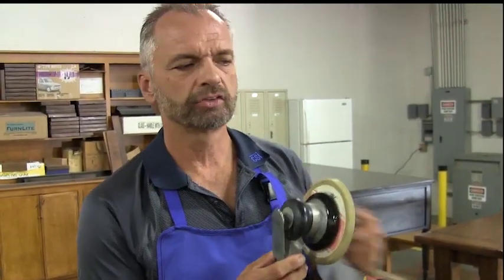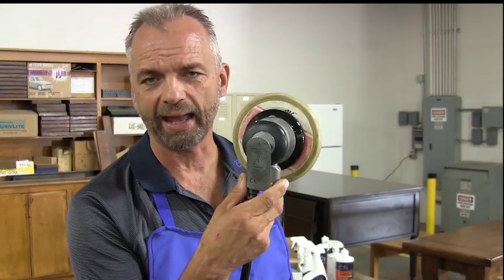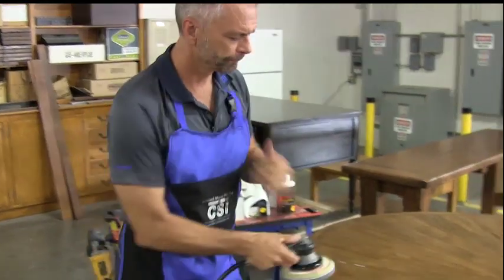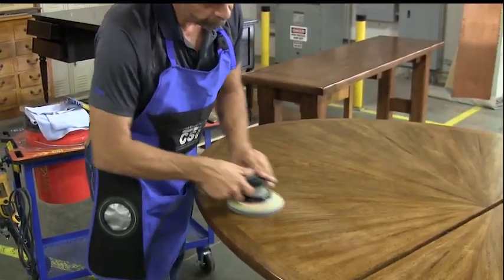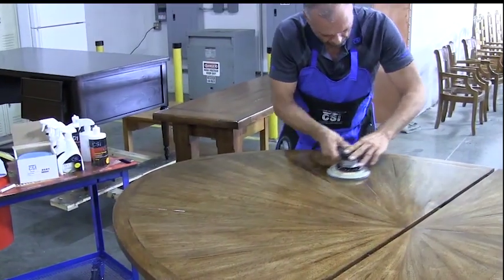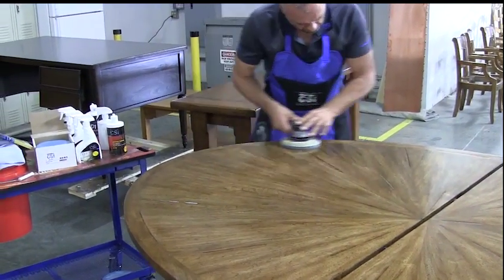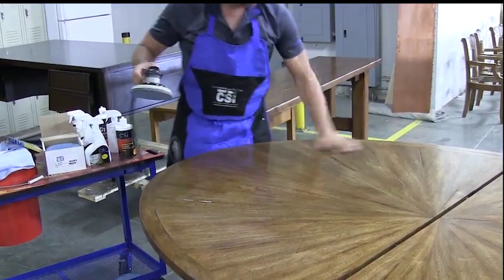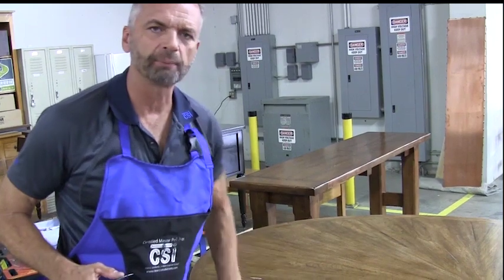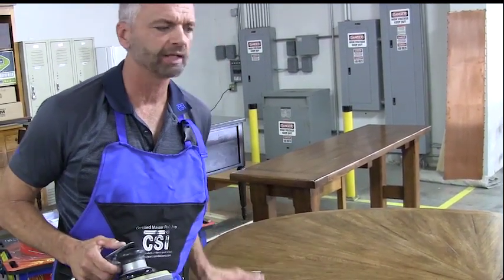We are going to start to sand the defects, or expose the defects, on the tabletop with a 3/32 DA, interface pad, and 2000 grit dry DA paper. This is a 6-inch dry DA. This is just to show the surface defects. Don't have to sand very much. We're just trying to expose any defects that might be there.